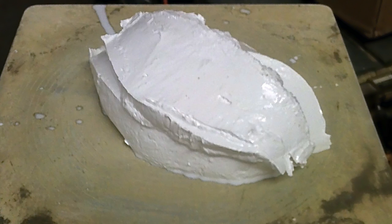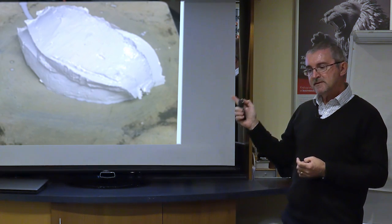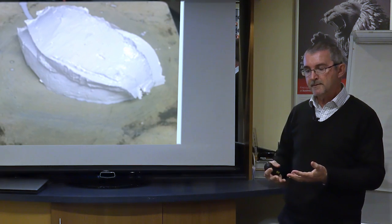So this is pure. Sometimes you'll see this referenced as being a fat lime. There's many different ways of describing it, but essentially this is your purest lime format that you might use on a construction project or a construction site. So in this state, this is completely inert. It will now be cold. It will have cooled down.